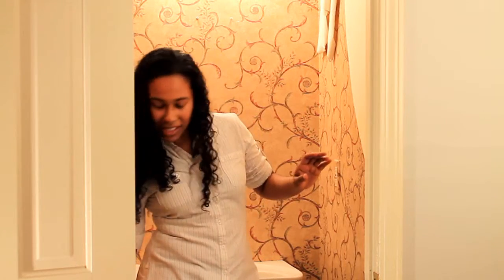First things first, there are two questions you're going to ask yourself before you get started. One is: what kind of wallpaper do I have? If it has a glassy, plasticky feel on top, that's going to be ideal for this method. If it's older wallpaper, check underneath to see if there are multiple layers, because dealing with multiple layers can get hairy — you might end up pulling some drywall off as you peel, no matter what method you use. At my last house there were areas with three to five layers of wallpaper and I really should have considered papering over some of those areas.